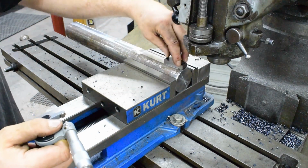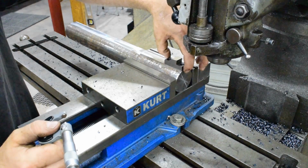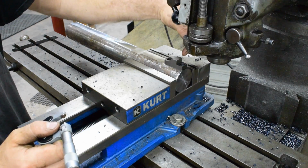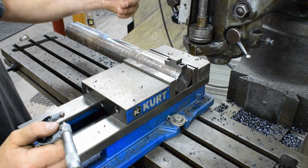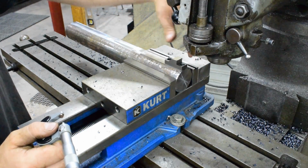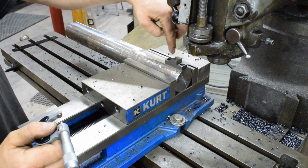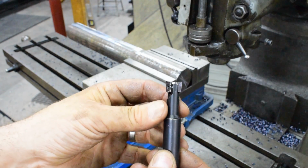And as far as the depth goes, oh, it'll actually fit in like that. We're just going to machine in from the end, not make a pocket on the bottom because I need as much depth as possible. With the slotter, I don't have a lot of travel. I've got 12 inches of travel. So I need to make this as close to the bottom as I can. And we'll just mill into here, and then we'll take a small end mill and square it out so it fits nicely. All right, guys, don't beat me up too bad.